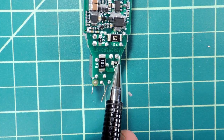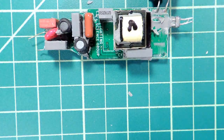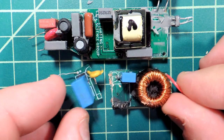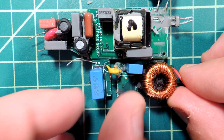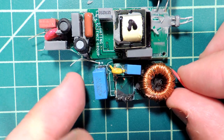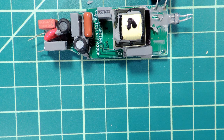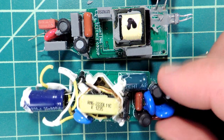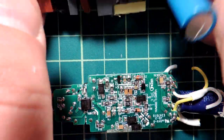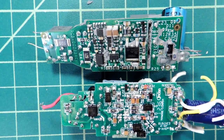What is interesting is that it's actually quite a large circuit board, and circuit board material is actually quite expensive. For example, the Switch bulb — I'll put it together here for comparison — you can see how much smaller it is. Circuit board material is sold on a per square inch basis, and you're probably looking at at least five or six cents of circuit board material that didn't need to be spent — clearly Switch went more compact. Even the most economically challenged bulb I tore down previously from GE has a straightforward design with a circuit board that is actually smaller. So this is a fairly large circuit board for the bulbs I've torn down to date.